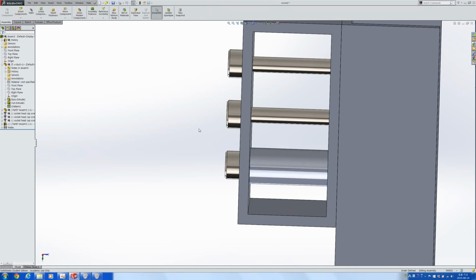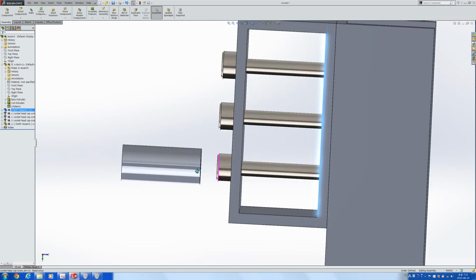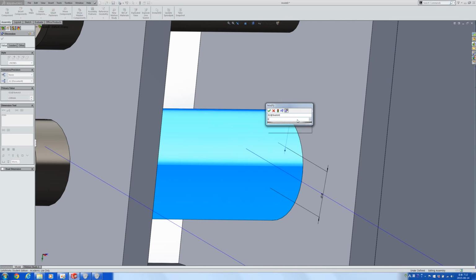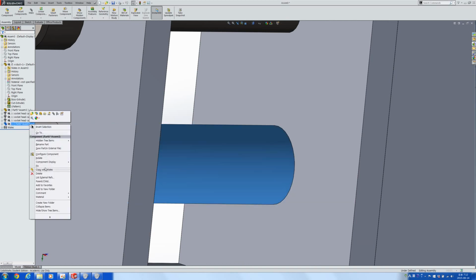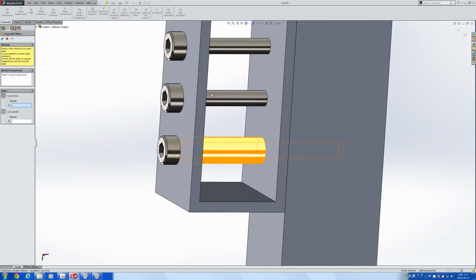And I want that to be up here as well, so I'm going to do a copy with mates. Copy that. Now I have that part, let's make them concentric. Make this fit. Alright. 2 mils may be a little too thick. Let's just make that 1 mil. And I'm going to copy that with mates. Concentric, coincident, yes. Copy with mates, concentric, and then coincident, copy, yes.